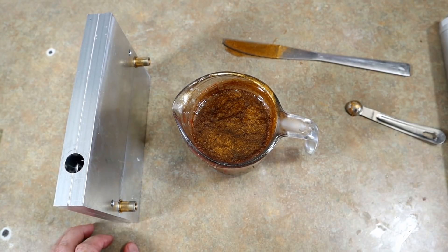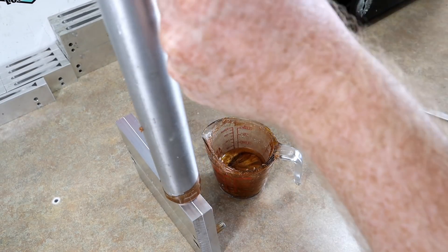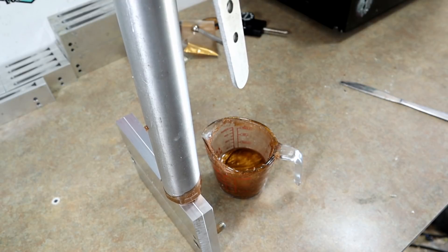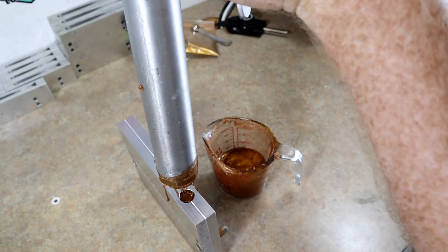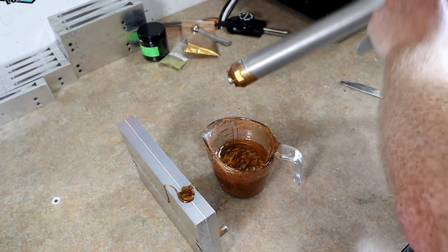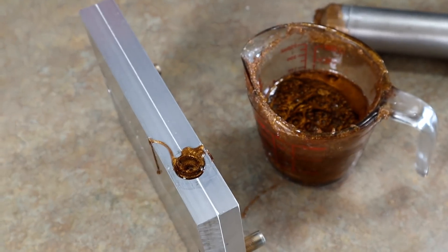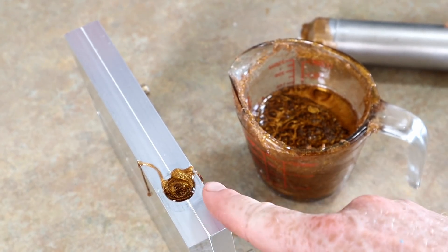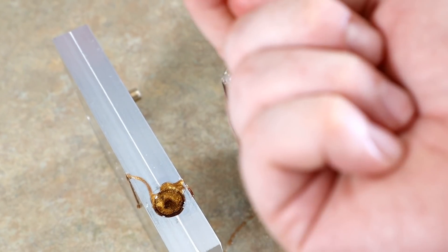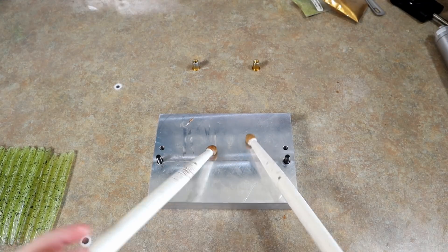The gold is super hot — let's go. That felt pretty good. I've done it enough that I can kind of feel when it's going to work. If you did not get all the cavities to fill, you'll start to see air bubbles come up — that's the trapped air from a cavity that didn't fill trying to escape back out. We should be good — let's see what these look like, drum roll please.